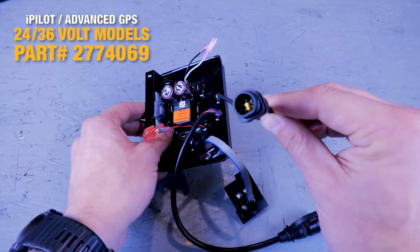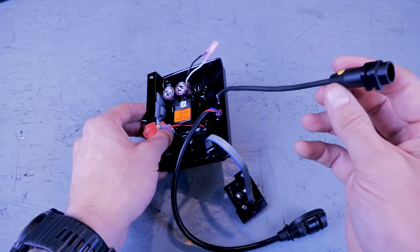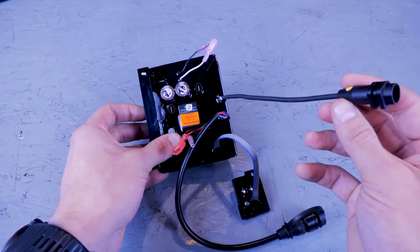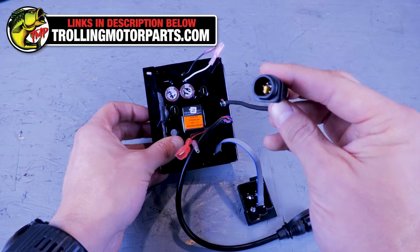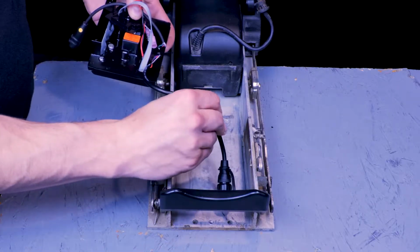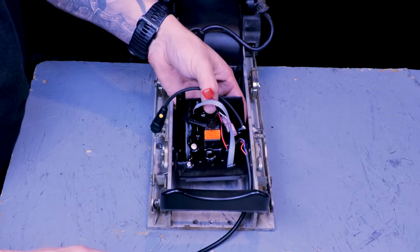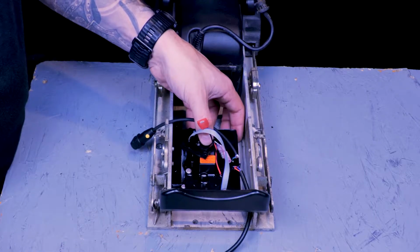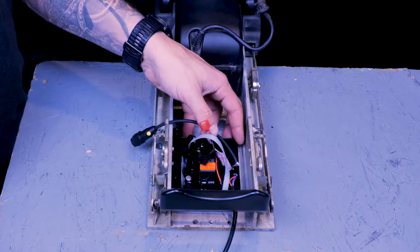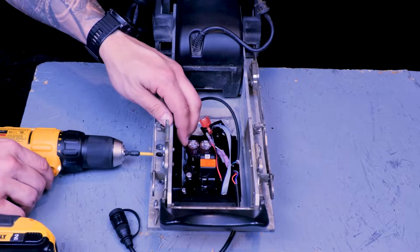Now, since we'll be disconnecting the AutoPilot and eventually adding advanced GPS to this motor, we're going to use the 2774069 board. Also, if you're wanting to add iPilot Bluetooth or advanced GPS to your motor, I'll put video links in the description showing you how to do that. It'll mount the same way as the legacy board did. Once it's lined up, we can put our two mounting screws back in.